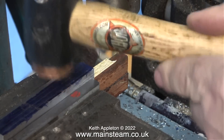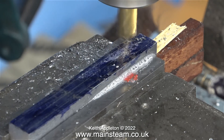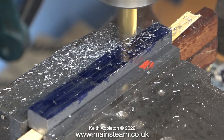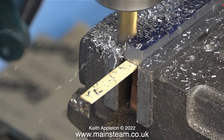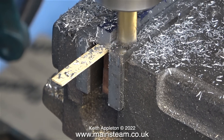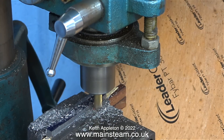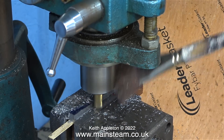Back to the milling machine — I added an extra piece of packing and tapped the bar into position with the soft hammer. A quick squirt of WD-40 and off we go. I have to mill down each side all the way up to the line on top and to the depth of the felt tip pen mark on the end. When side milling like this, it's really important to make sure that you always go in the direction of the cut, never against it. As I start the cut on the other side, the machine is throwing very hot chippings directly at me, so I've put a piece of gasket material between me and the milling machine.